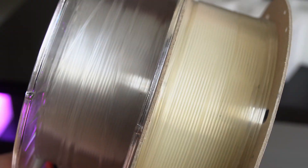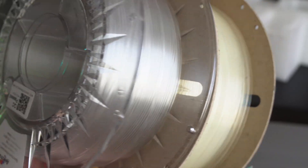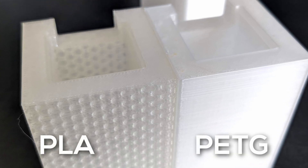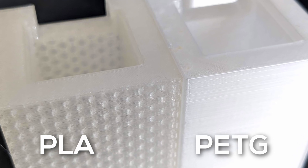While transparent PLA is great and it's super easy to print and quite cheap, I did notice that on its own it looked perfectly fine. But as soon as you put it next to other white stuff it just kind of looked a bit yellowish, which gave it a cheap, old aesthetic that was really not fitting. So I ended up moving to clear PETG. It is about the same transparency but it does not have that yellow tint — it is very neutral in color. And while by themselves they look very similar, having them next to other white things, for example with a white tabletop, you can really tell a big difference.